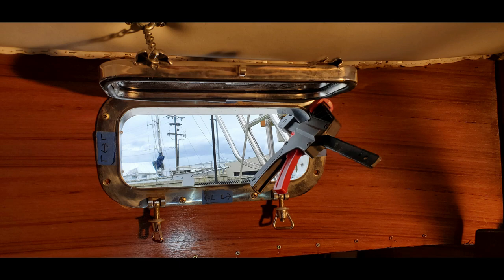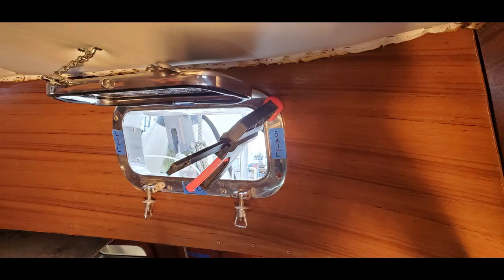Time to start locating some holes. First we're using clamps to clamp the plywood and the port light frame closer to the back part of the cabin top fiberglass section, otherwise our screws aren't going to reach. It's forcing the plywood to bend and conform to the round part of the aft bulkhead. We have to be careful not to go too tight and bend the wood farther than needed, but close enough that the screws will start once holes are located — it's a delicate balance.